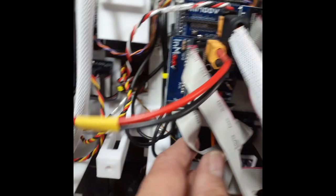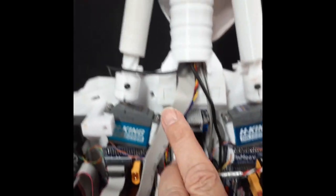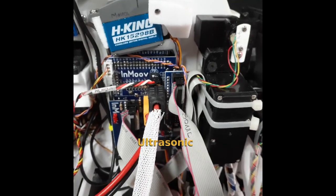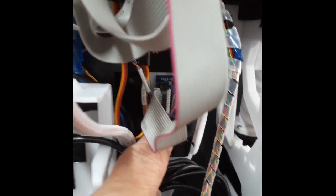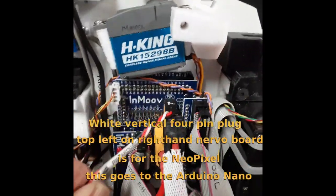There is another neck board — that's board 12A — which runs the roll neck with two servos. This board also handles the sonic sensors. You can't run two simultaneously, so even though there is a left and a right sonic, only the right sonic is used. It connects down to another nerve board which runs the sonic, and there is also a PIR sensor next to it.